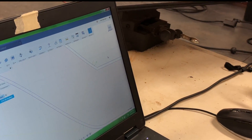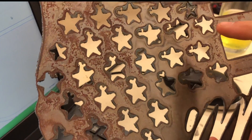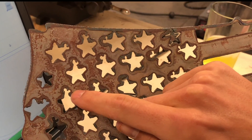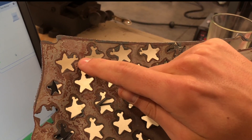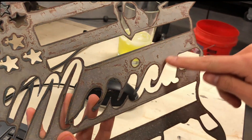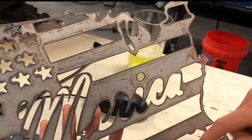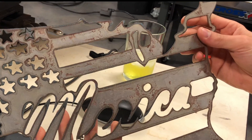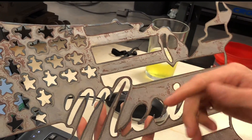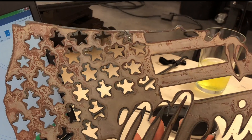A good example of that — this one is screwed up. The arrow was on the inside of the star, which is a perfect star, but if you notice everything else, the profile started on the outside of the contours. So you've got that firing on the outside, sweep in, sweep out. All of these letters did really well, except right there. This is a thin sheet that was scrap. As I started noticing this, I said, oh crap, that's a problem. It cut through my part right there — that's my own mistake.